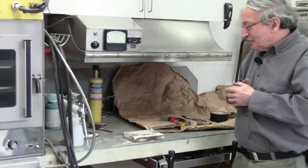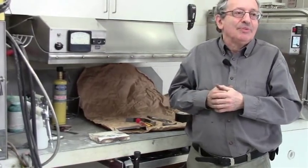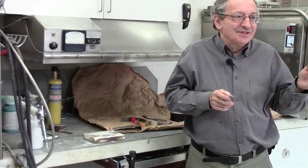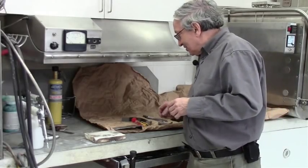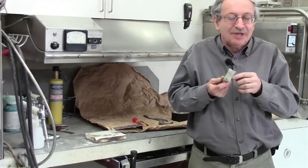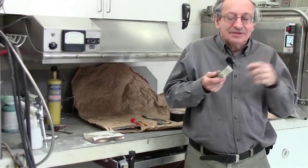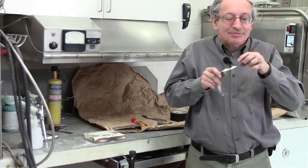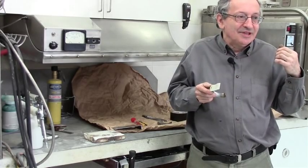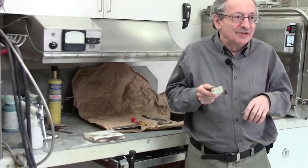The big advantage of heating up an object before painting is that anything which can give you bubbles or defects in paint will disappear in the first round of heating. Let's say I have a piece which is welded and drilled and there is some moisture trapped or some cutting oil trapped in it. If I powder coat it and bake it, this cutting oil will bubble out and make defects in the paint. But if I heated it up once before painting, everything which is volatile came out already, so the paint job is more likely to be perfect.